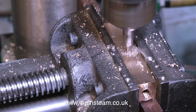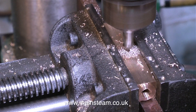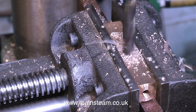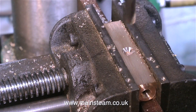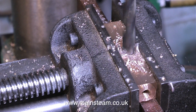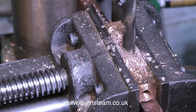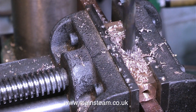Just look at this — the centre drill is wobbling all over the place, but by default it usually finds its centre. When I work at the steam workshop, I use a drilling machine called a Fobco Star — that's very old and very accurate. I've drilled the holes to take the boiler bushes in two different sizes, and in this clip I'm drilling a hole underneath to take a fitting that I have yet to make, to allow me to screw it into the top of the boiler.